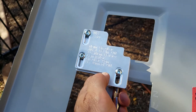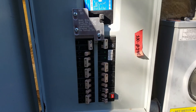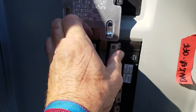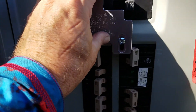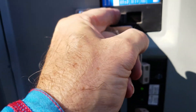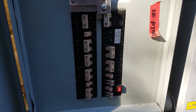To trace it, I screwed the holes from the outside, put the screws in through the back, then tightened the little nuts that have a screwdriver head on them so this thing can slide. This fits really snugly. We don't want the main on when the generator side is on. This goes up — now I can power the generator and determine which breakers I want on. Everything is off including the sub panel and the generator's off. This slides down and I can power the whole house. They are mutually exclusive — this goes off, this comes up, and they can't both be on. Now I need to update my charts.